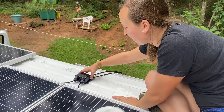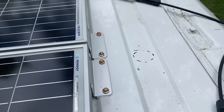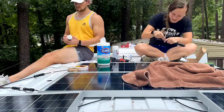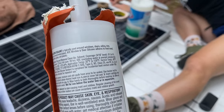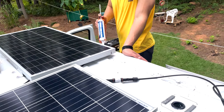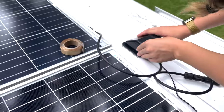Moment of truth. This is where we want our cable entry housing to be. We have our wires pulled through our cable housing, except for the WeBoost wire. We double and triple checked that our placement was correct, then took the hole saw and marked around it so we could tape up there and make sure everything is set. Now Phal is putting on the rubber grommet with an ample amount of silicone — tack free in 30 minutes. Phal will hold it and then we'll put the wires in after all the grommets are in. We're siliconing the screws to make sure they don't leak through the ceiling. The bottom of the housing has four layers of butyl tape in the valley plus 3M VHB tape.